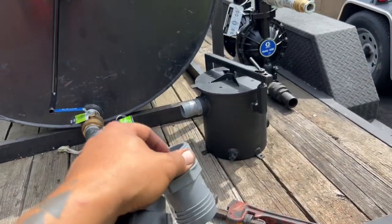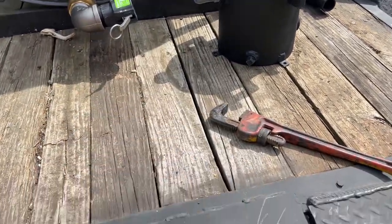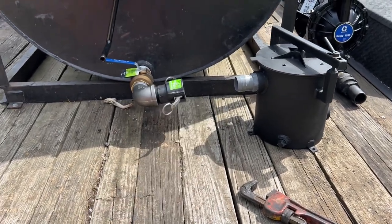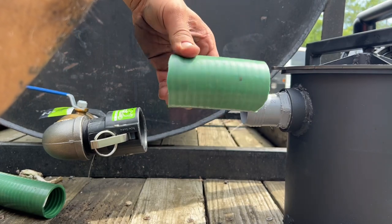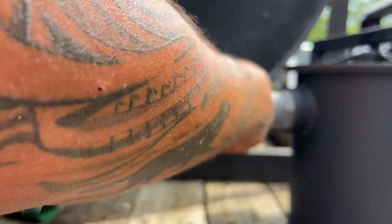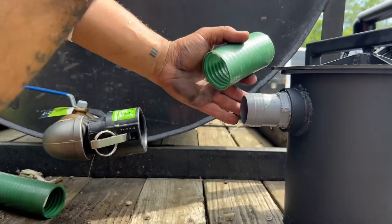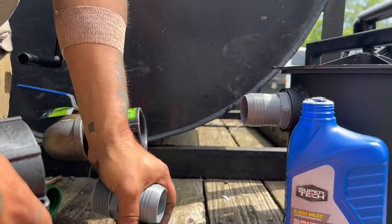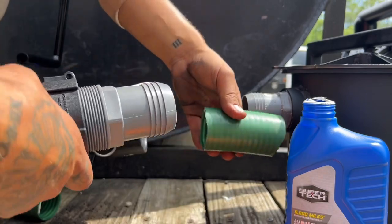So you can see this has a nipple here. We're going to put a piece of green hose there — the nipple will go into the piece of green hose, and then this will screw onto the end of this. This is the gator jaw; it'll go in there and lock. This is a green ag hose — you can find that at Menards or Tractor Supply. Most of the time when I'm building a unit, I'll put oil on here to help that go on. It's a tight fit. We'll put hose clamps on each end. We're going to put this together separately first, because if this was already in the hose it's going to be really hard to grip and spin it on.